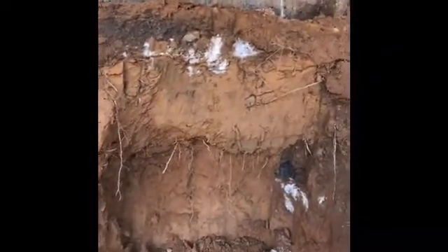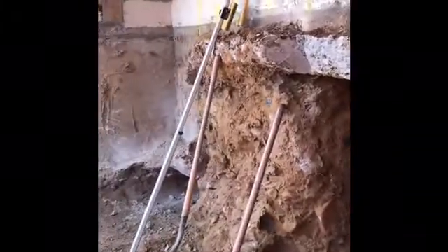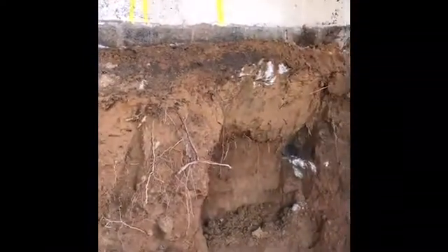All of these will be formed and poured according to the underpinning schedule. Now our footings will be at the right height below our floor and have no chance of blowing out. This is important for a few reasons — if you left the footing midair like this and poured in front of it, the only thing holding these is dirt, and that's not really a good option.